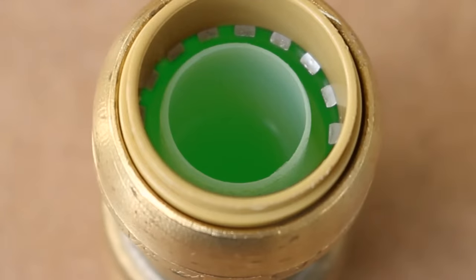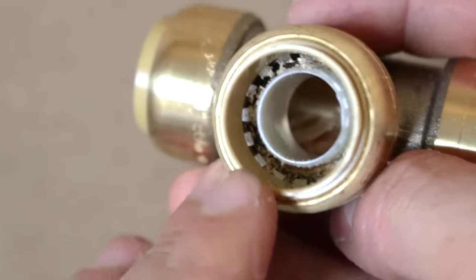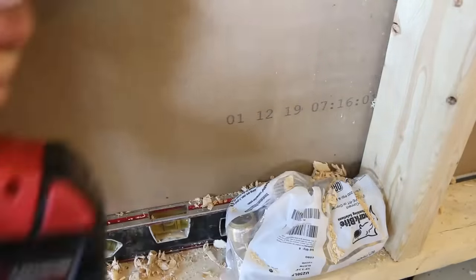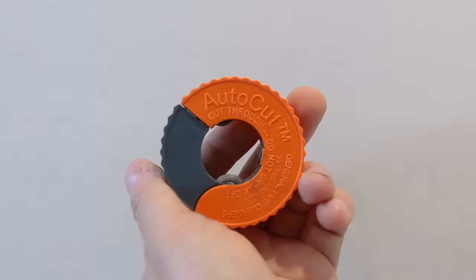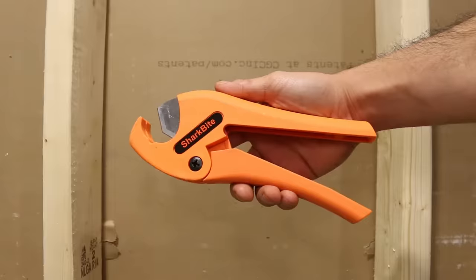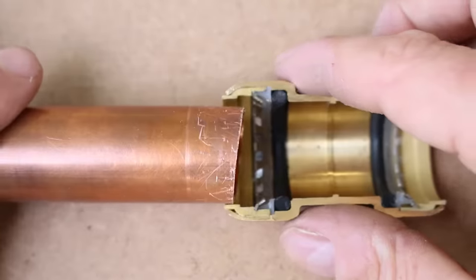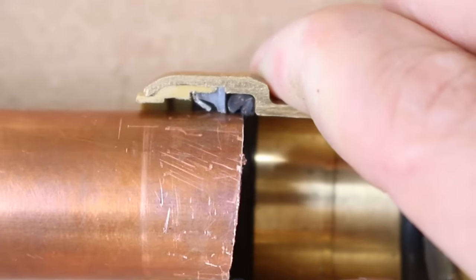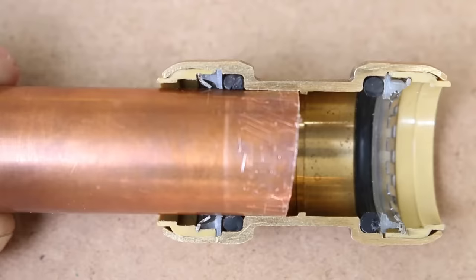The first thing you want to make sure of is that the fitting is clean. Many times I've seen people put their fittings on the floor or in the wall while plumbing, allowing all kinds of debris inside the fitting. This could lead to a leak if something gets in between the o-ring and the pipe, so always keep these in their bags or in a sealed container prior to installing them. Secondly, the pipe absolutely needs to be cut straight using either a rotary cutter for copper or blade-type cutters for PEX and CPVC. If you cut copper with a hacksaw, not only will your cut be crooked, but it'll leave a rough outer edge that could potentially pinch or rip the o-ring upon insertion, which will guarantee a leak as soon as you open the water back up.